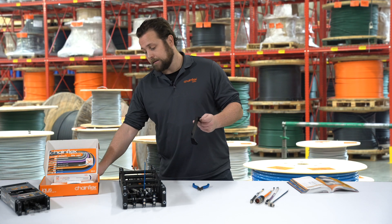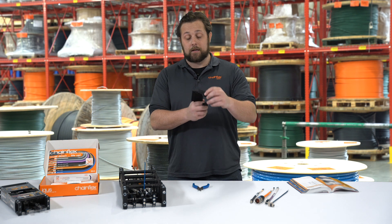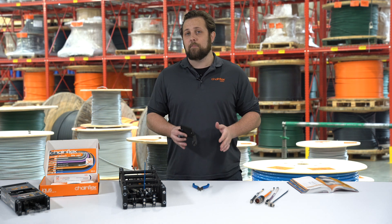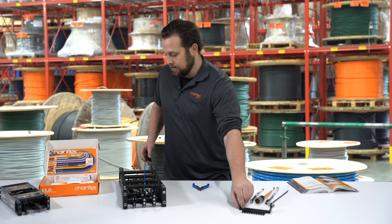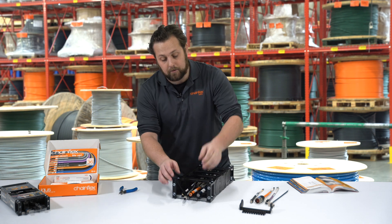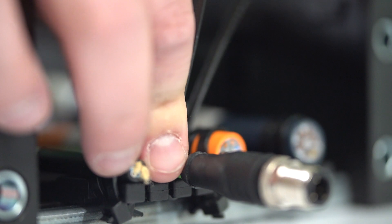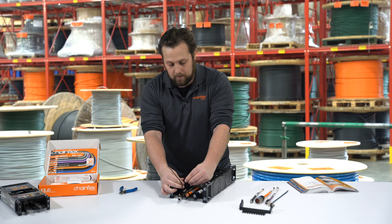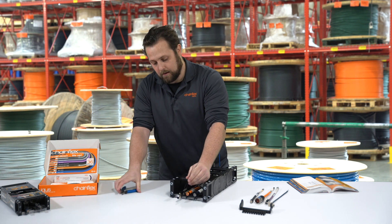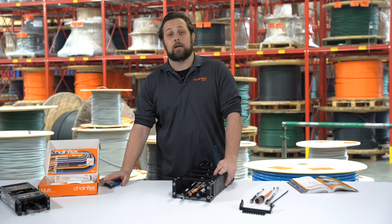Now we're going to talk about tie wrap plates. As you can see here, two very different sizes — and IGUS offers a litany of different sizes of tie wrap plates. Here affixing to the end of an E-Chain, it can also be affixed anywhere on your machine, still ensuring the principle of strain relief which keeps the cable length in your E-Chain system consistent. The most important part about tie wrap plates is the teeth. You want to affix cable ties underneath the teeth as you see here, then tighten those cable ties around the cable. We normally suggest using two cable ties per cable — as if one fails you have the backup. Take off the slack of the cable ties, and here you have a properly strain relieved cable with the tie wrap plate.